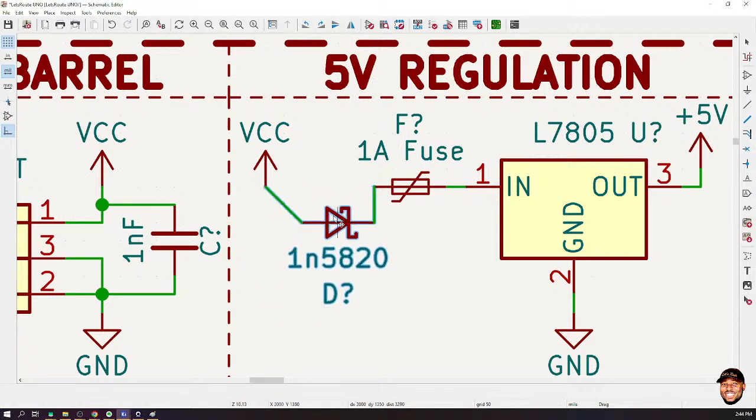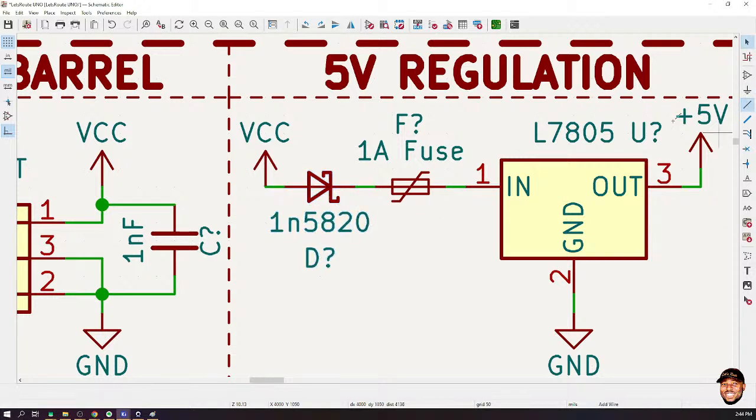So if that situation happens, then you are going to have something like this. It will be like you have your diode and you have bypassed it. Because if you are routing the PCB, this connection will mean that you bypass this diode. That means, in essence, the diode will be there doing nothing. That's why I said always be careful when you are putting these things.